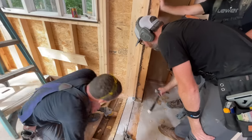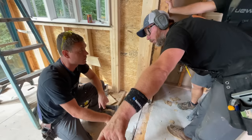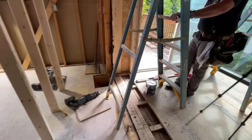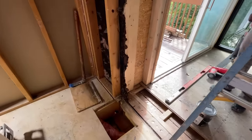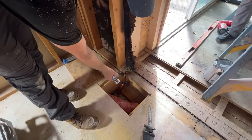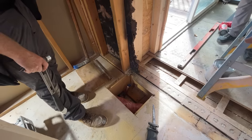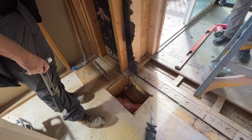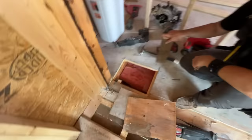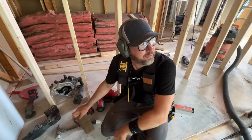We better cut a hole in this side as well and just make sure we have solid blocking underneath our jacks here — because on that side there wasn't any. Construction terminology time: those are called squash blocks. We're going to add another and definitely block it — that's the concrete block wall below, so we're good there. We're going to put all the weight on that.